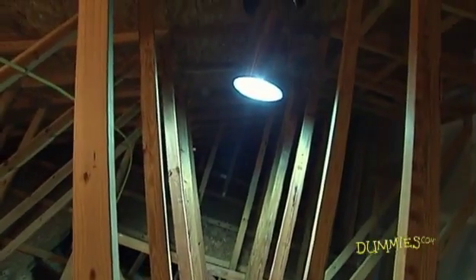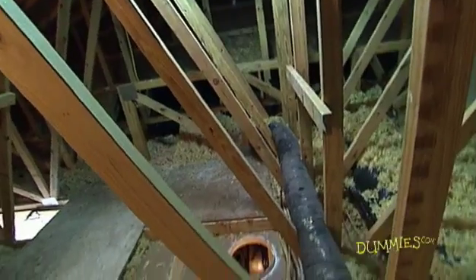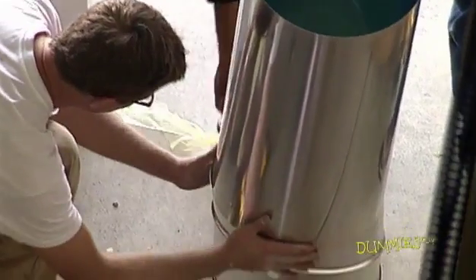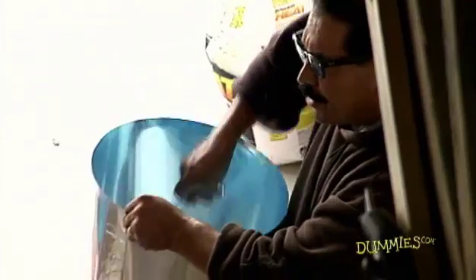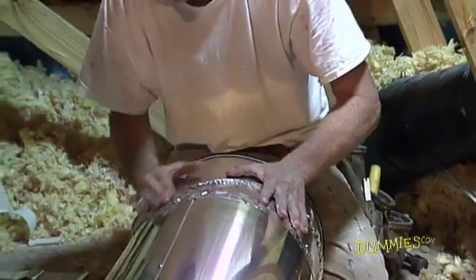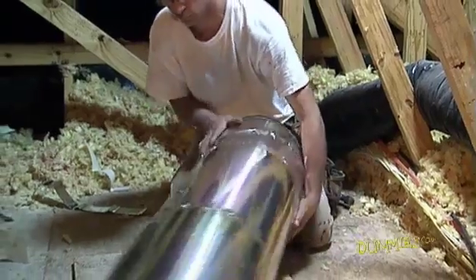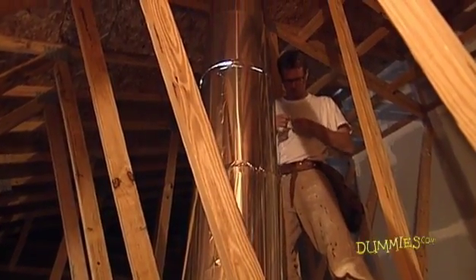Now go back in the attic. Find out how long the straight tunnel section and lower elbow needs to be to connect the upper elbow in your roof with the hole in your ceiling. Adjust the angle of both elbows if necessary. Remove the film and put together the straight tunnel sections, connecting them with the elbows. Make sure the top section is on the outside of the upper elbow and the bottom section is on the inside of the lower elbow. Do not cut any of the tunnel sections; instead, overlap the sections more.